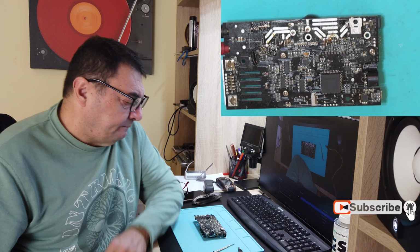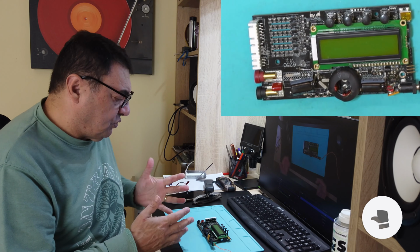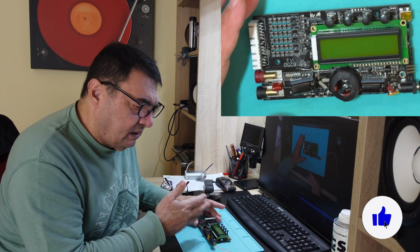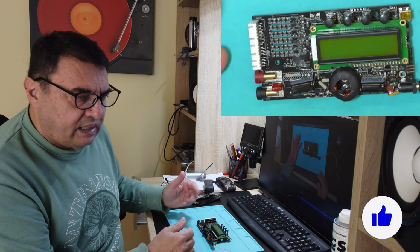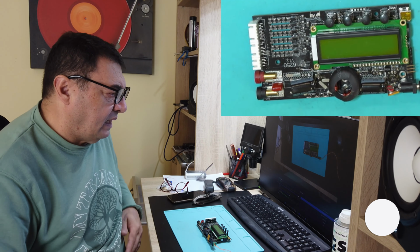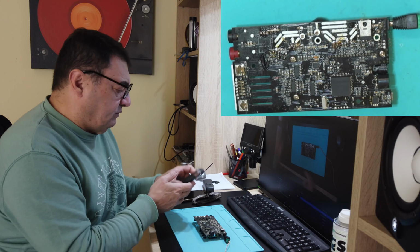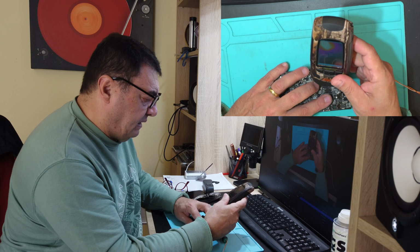Okay, so now let me see. I can hear the buck converter is trying to do something. I can hear a noise there, so we still have a kind of oscillation. My power supply delivers like 300 milliamps, and I'm not sure. Something is getting hot here, so we can take a look. This is the main processor, which I feel warm, not exactly hot.